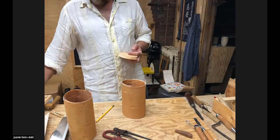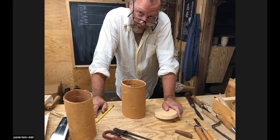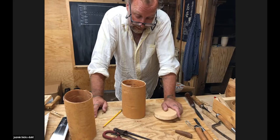If you don't have access to a sawmill and sawyers, I would take 2x6s and mill them down on the table saw to get that inch, instead of trying to find it. But now I have rough sawn lumber, so I can get 1 inch material. You can mill it down or have someone mill it.